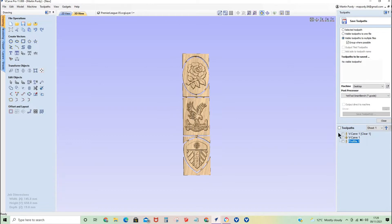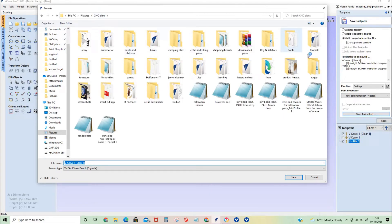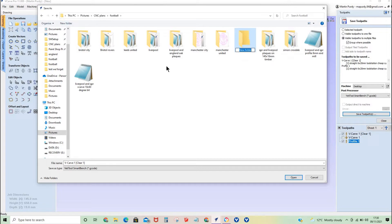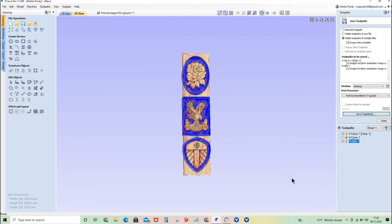I'm happy with the two tab bridges - it's going to hold everything together. So I'm going to save some G-codes using visible toolpaths. Effectively I'm going to run the clearance toolpath, then run the profile toolpath on the same cutter, and then come back to the 10mm V-carve path which will be the final clearance pass. I'll save this file as 'Mixed Triple Plaques' and then save a version as 'Mixed Triple Plaques 6mm cutter'.